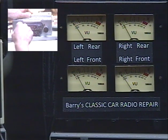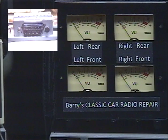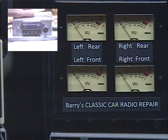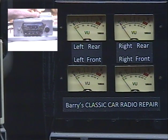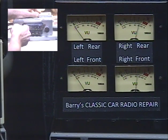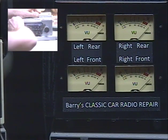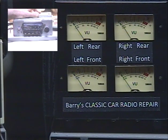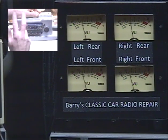Since I don't have a knob on this control it's kind of hard to keep it pulled out and turn it. Now we're going to activate the left-right balance control — same procedure except we rotate the tone control twice to the left. There are our beeps — now the tone control is adjusting left-right balance. It's hard to hold on to without the knob. Let it time out — we've demonstrated the virtual fader function and the virtual balance function.